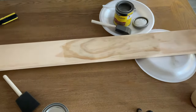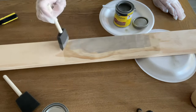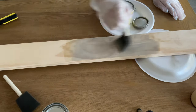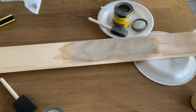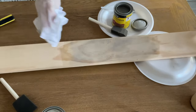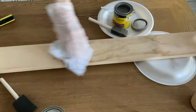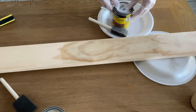I decided to put a pretty heavy layer on it, and then I took my cloth and wiped that color off. When you wipe it off, you don't really see the gray — it just kind of darkens the pine wood, gives it a little bit of a darker color, which looks nice. I went ahead and did two passes just to see what it would look like, then wiped the second coat and left it to dry to see if it darkened up any more.